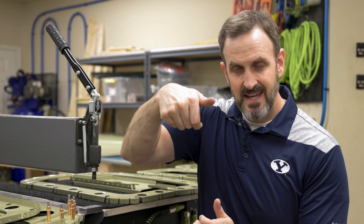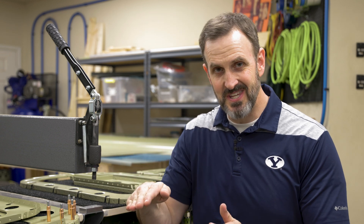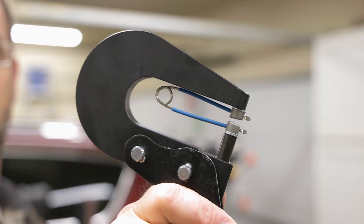You kind of sneak up on it - squeeze a little bit at a time in a semi-random pattern. I actually did every fourth or fifth rivet, then the ones in the middle, and so on. I put those rivets on, turned the thing over, put the back-riveting plate beneath the elevator, and started riveting. The first thing I did was use the rivet gun perpendicular to the table, then rotate it so it's perpendicular to the skin - only setting the rivet maybe 50%. People on Van's Air Force say they did it 60% or 40%; I did it about halfway. Then I came in with a Cleveland Aircraft Supply trailing edge tool - something you use with a squeezer that has rivet sets at angles matching the trailing edge - and set the rivets further.